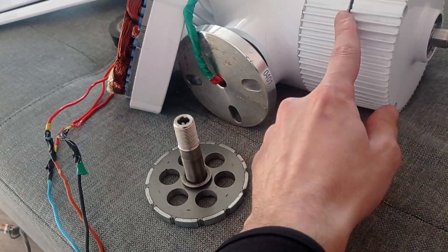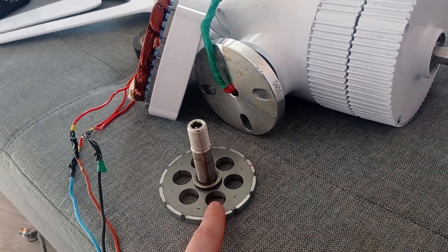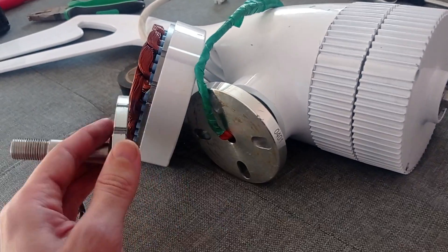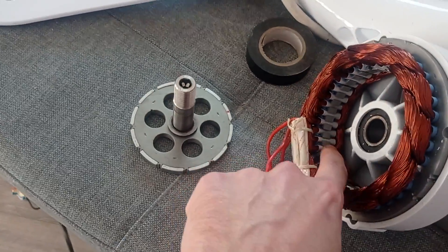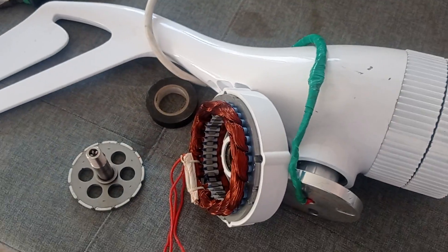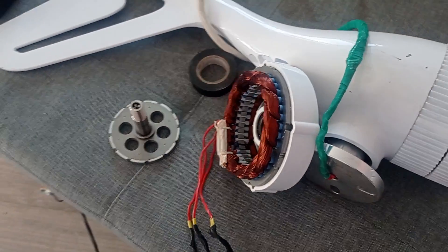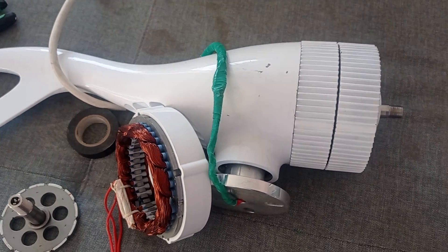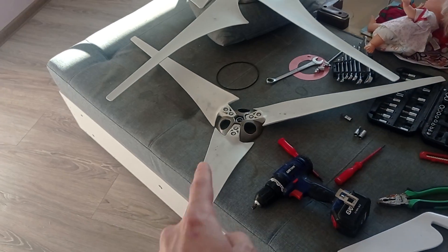The difference between the two is very simple: if the original rotor is eight millimeters thick, the rotor for the new generator is 25 millimeters thick - so it's three times bigger. Three times bigger in thickness, and this outer part is also about three times thicker, which means it will have really a lot more power - not just three times, but way more.